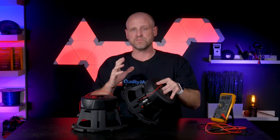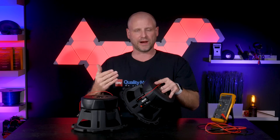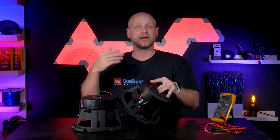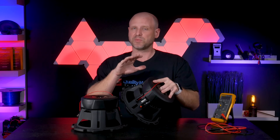The benefit to a lower impedance at the amplifier is typically the amplifier will output more power. The amp must be rated for that power and for that load. A 1 ohm load will typically have twice the power of a 2 ohm load, and a 2 ohm load will have twice the power of a 4 ohm load. That will depend largely on the amplifier, the output capabilities, the power supply, and the type of cabling you use with the amp.